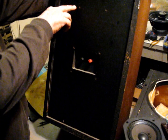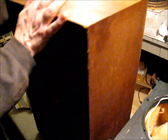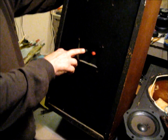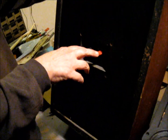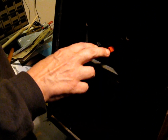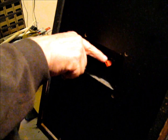Notice — I don't know if you can see this in this light — but there are six screws here in the back, and that's what holds the crossover in. These cam locks on several different models of JBL are probably one of the worst connectors ever designed by anybody. I always replace these connectors with binding posts when I do this work, because the plastic breaks, and once that plastic cracks, the cam doesn't grab the wire anymore.